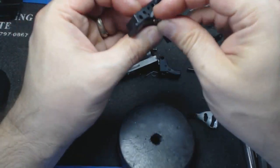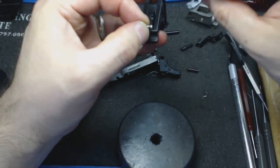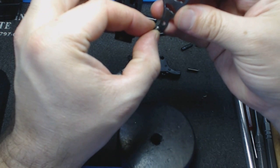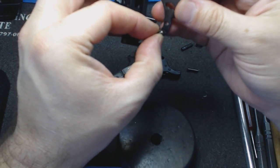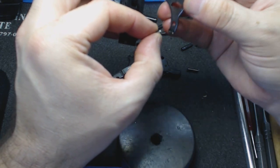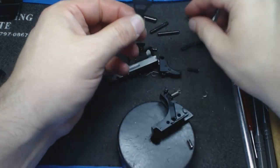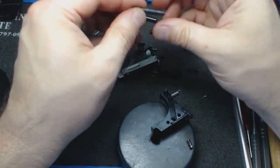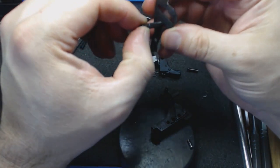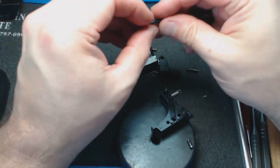So that was sitting in this big hole and pushing against these two little indentations in the plate, so that it snapped down and snapped back up as the plate rotated around. So that gives it that positive retention, staying in one place. Also notably, the takedown pin, the reason we had to be in the middle is because that's the only place, whoops, that's the wrong pin. Helps to demonstrate that with the correct pin.